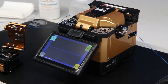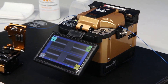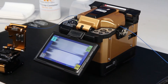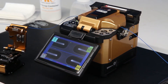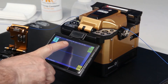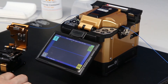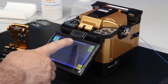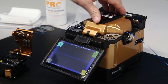Here I'm going to hit the set button. It's going to go through, it's going to align, and it's going to burn. What it's doing is burning each time — it's measuring the distance that the fiber is pulling back. You can see at the top of the screen it says I have an 11 and a 7, and they need to be within two of each other. The fact that this is red and that's green means I'm going to have to do it one more time.